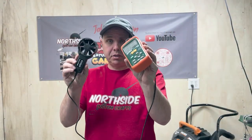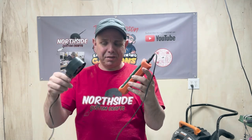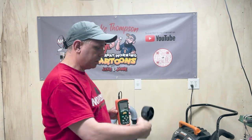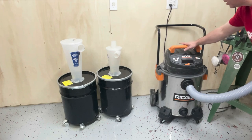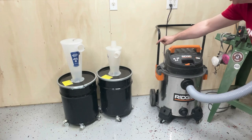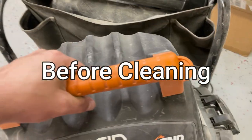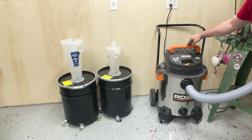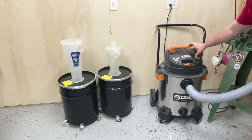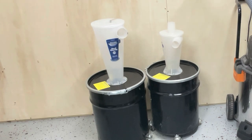Here's an anemometer — we're going to use this to measure the airflow. I'll put a link to this on Amazon in the description below. There's some math to get it to read CFM — I'll link the video I used for the math. I'm not a mathematician, but we'll use this: I'll straighten out the hose and measure the old one, then switch to the new one and measure that. This is a Ridgid 6.5 horsepower wet/dry vac. I use it combined with the old Dust Deputy while turning on the lathe. I just cleaned it and put a new filter in for best results — I had never changed the filter before, just blown it out once or twice over about six months.